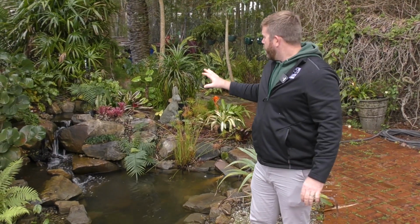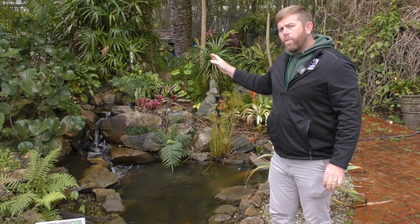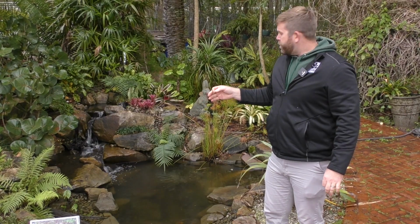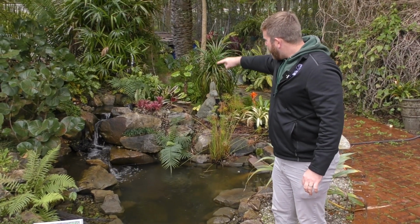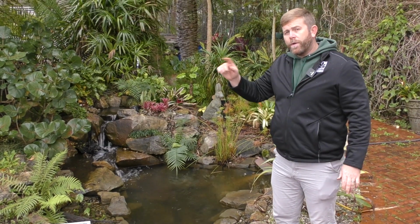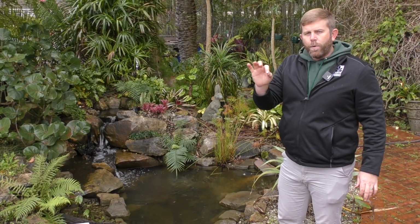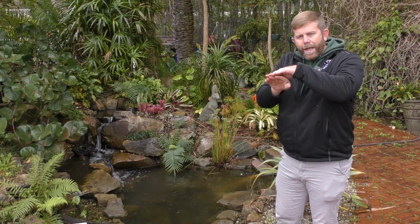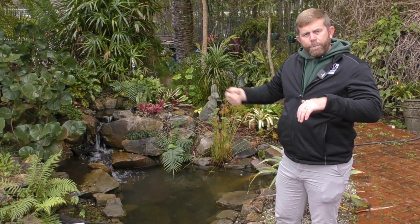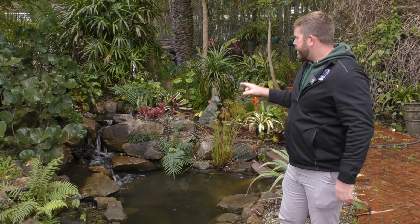You want to start with the waterfall where the water's getting over the liner. That's the more common thing, and it's a very easy fix. You just trace the liner from top to bottom where the pond is, and if you find any water getting over it, and I'm telling you, it can just be a small trickle. It finds where the fold happens and it's getting out through the fold. Very simple fix, just lifting the liner, packing dirt in, easy fix.